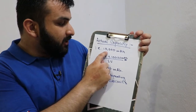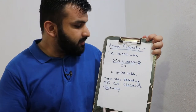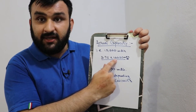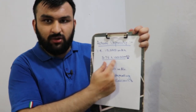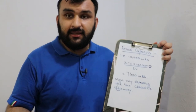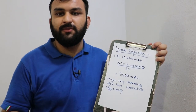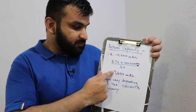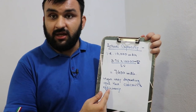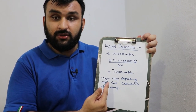So as I mentioned earlier, if you want to measure the actual capacity of your power bank and don't know how — it's pretty simple. I'm considering a 10,000 milliamp hour capacity power bank, but you could do any capacity power bank you want. In this case, the nominal voltage of the lithium-ion battery is 3.7 volt, and it is multiplied by 10,000 milliamp hours, and then divided by 5 volt — the output voltage of your power bank — and it equals 7,400 milliamp hours. That is exactly the output of my power bank; it charges my smartphone for about three times from zero to one hundred percent. This is pretty accurate, and as I mentioned, the output might vary depending upon the efficiency of your circuit, so keep that in mind.